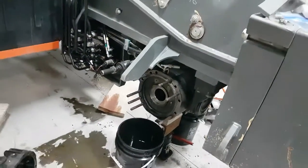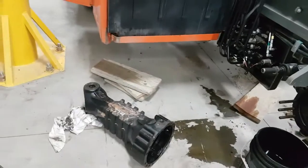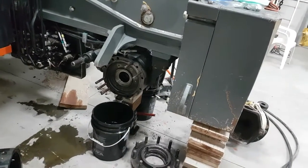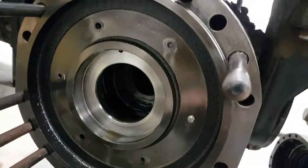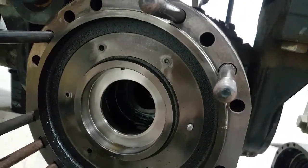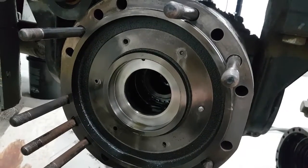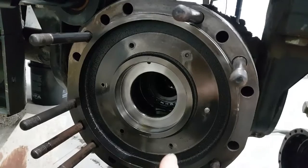The reason I pulled this axle apart was actually from a different issue — we had a final drive that didn't see any oil for a very long time and pretty much exploded. Since I was already in here, I figured I might as well do the brake seals and found some other problems as well: a bunch of broken studs on the retention plate that pushes back on the slave cylinder. In diagnosis, if you have a telehandler that seems really gutless in some gears, especially second gear, it might be that your retention plate has busted off and your brakes are dragging.